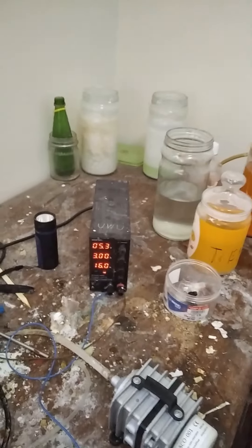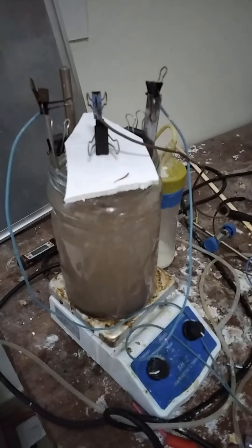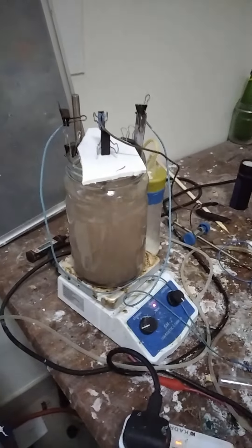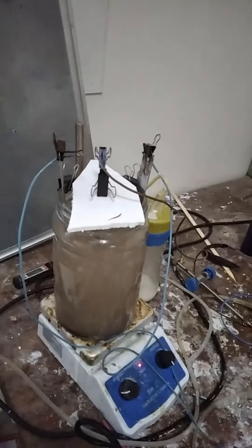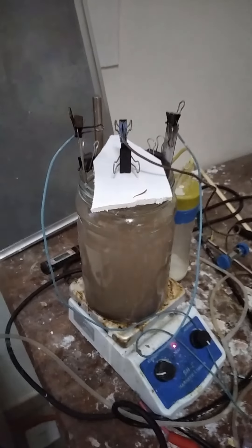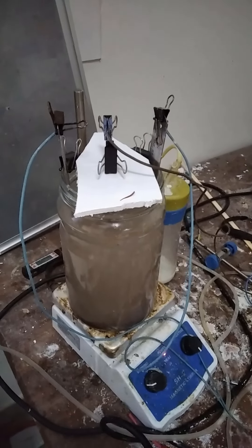After checking the electrode, the voltage didn't really rise much — it's the same, which is really good. Stuff is still fine, but erosion does seem to occur. However, it erodes differently from the last time I plated an electrode. Normally when lead dioxide erodes it comes off in large plates, but I'm getting particle erosion, which means the material underneath is still active.